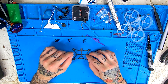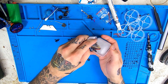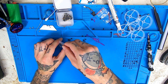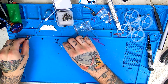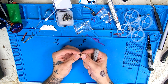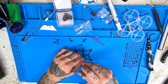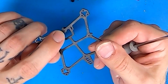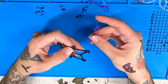Before we do that, we should open up our flight controller because we need the grommets to put around the screws. That'll help hold the screws still and will be needed to hold your flight controller. Grab three of your grommets and set the rest aside. I like to start by putting the rear screw into the carbon — put my grommet around the screw, use the larger of the two screwdrivers, get it nice and straight, put pressure on it and slowly start turning it in. It should be almost flush with the bottom of your carbon. Now that the back screw is in, I'm just going to get the camera mount started.